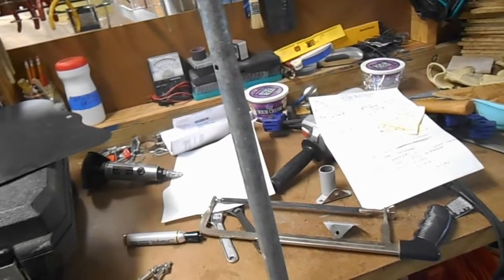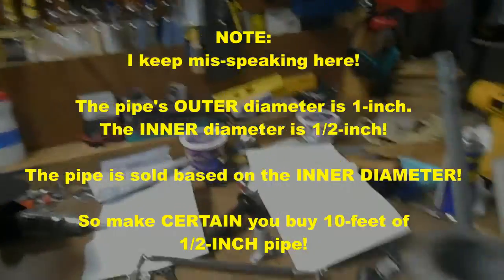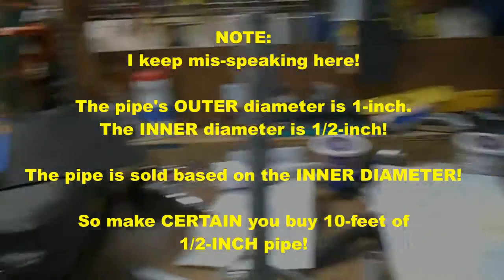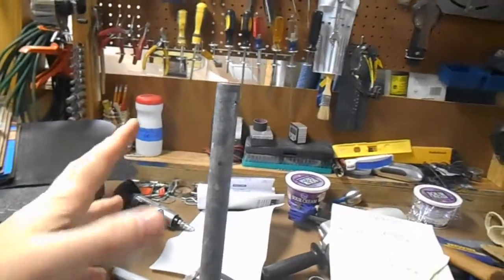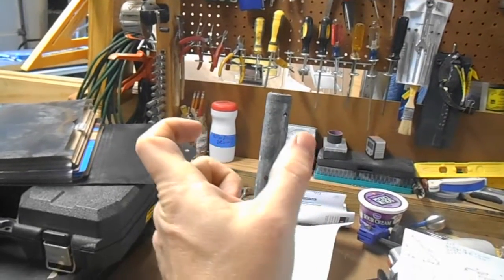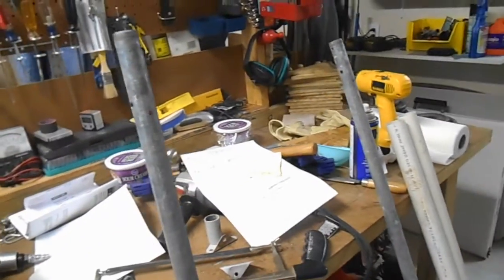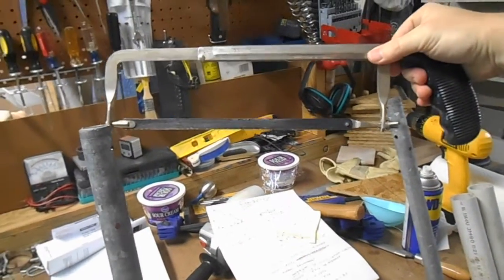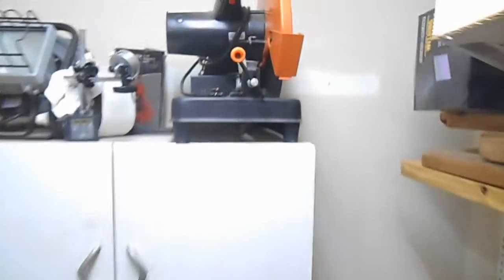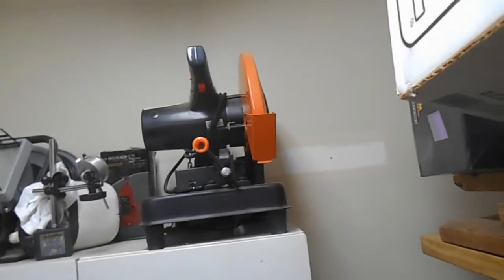Now comes the actual hard part of putting the rack together and finishing the last few pieces — the cross pieces. These are one inch galvanized pipe. You can get this in various lengths at your home center. I had cut two pieces based on the overall dimensions of my rack — these are about five feet long. They extend past each of the vertical uprights about two to three inches on each side. The trick is these come in pretty long lengths, and cutting them can be a real pain. This is the point where all the elbow grease comes in with a hacksaw. I used a metal grinding wheel cutoff saw, which made pretty short work of it and is a better solution — if you can borrow one, do so. It'll save your arm and probably save you 20 minutes of hacksaw work.